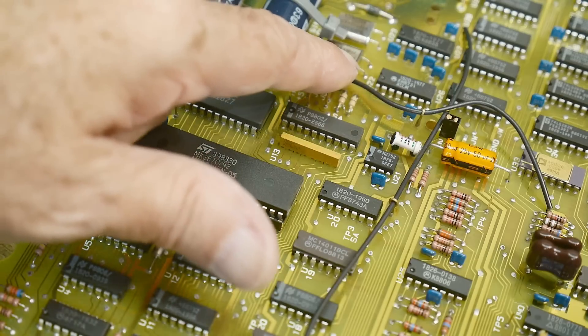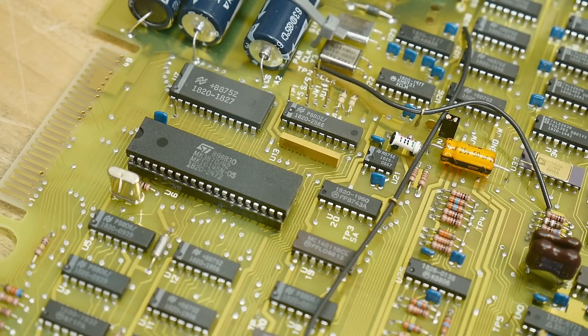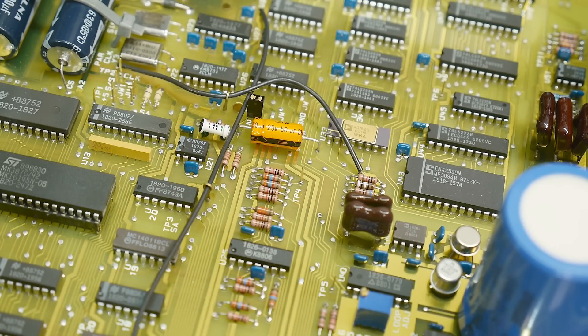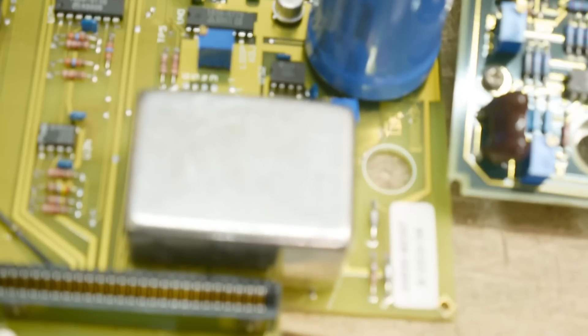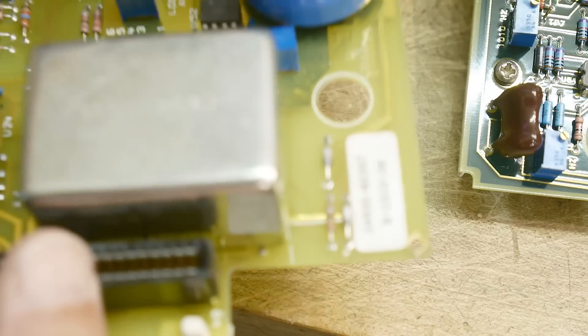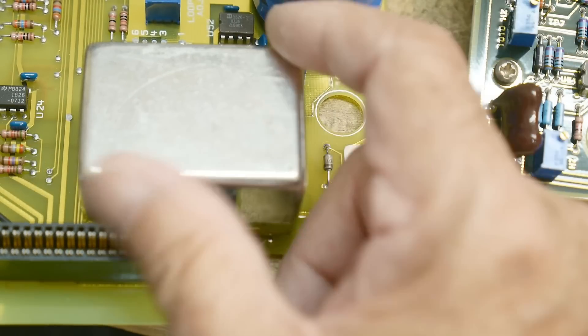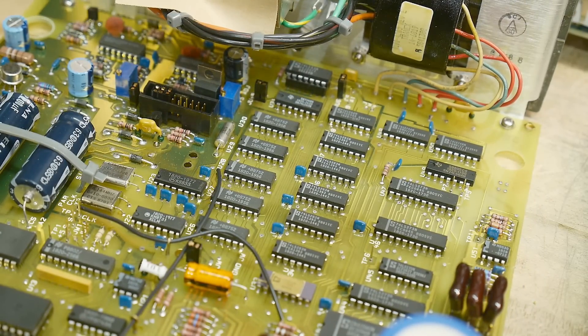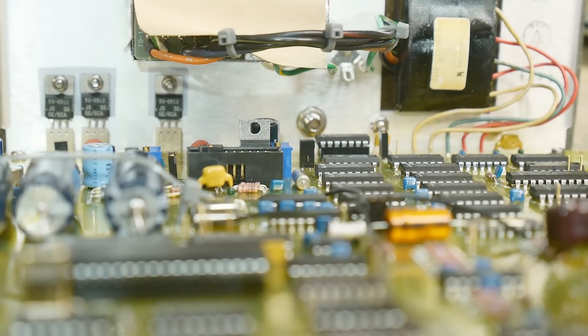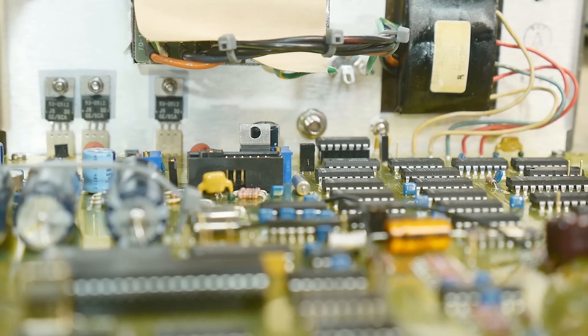The clock speed reads at 4 MHz — so it's a 4 MHz microprocessor from the old days. There are some other clocks here: 6.144 MHz and 4.194304 MHz — some weird clocks. There's an Analog Devices chip here, probably a DAC type of thing. There's also a really weird block, part number 9100-2847 — might be a DC-to-DC converter or a clock module. And it's got three-terminal regulators on sockets hooked up to the back panel.